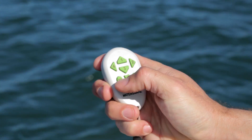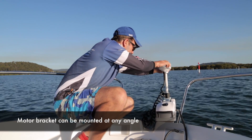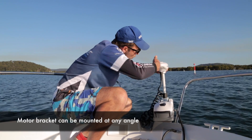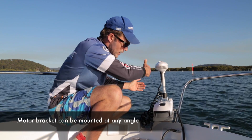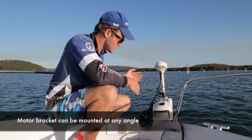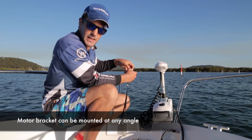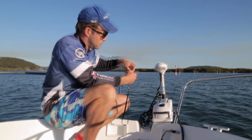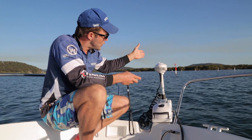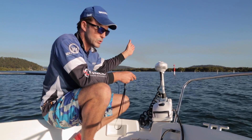Turn the engine on by pressing M, then take it and line up the propeller and the head of your trolling motor so that it's in line with the keel of your boat. Once you've done this, hold down the forward and the reverse button simultaneously for five seconds. The trolling motor is now calibrated with the boat so that it always knows which way is forward.